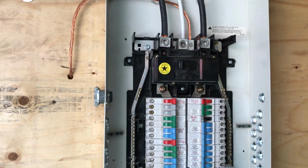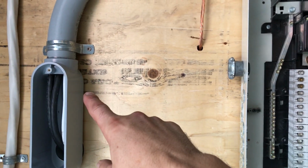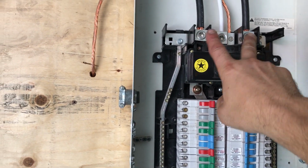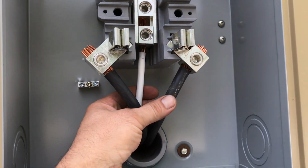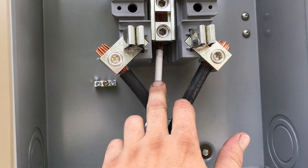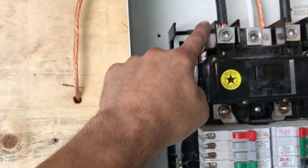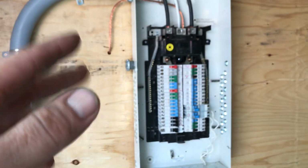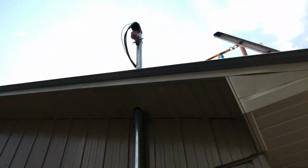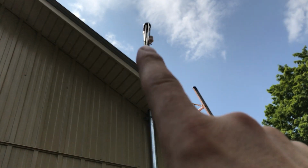But what I did first was, I did from the underside of the meter base to here. Okay, no slack, no excess. I went out there, started from here first. I did the bottom side of these, one at a time, fed them in, fed them through here, right? And finished that off. This way, any excess wire, I just left it up there because I need to leave like 30 inches of wire up there.